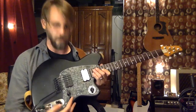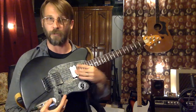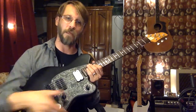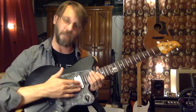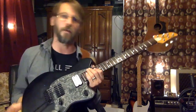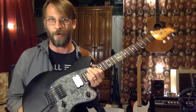Combined with our three-way selector switch — which in this case is not a three-way pickup selector switch — this only concerns the neck humbucker. So right now in the foremost position, that is a traditional humbucker but wired out of polarity with our rear position. This was very much a Jimmy Page trick; he used that for a lot of his nasally tones he managed to get out of Les Pauls. In the middle position it's the typical in-polarity — so at 50% you get that normal warm blend. And then in the back position, it actually just switches over to the front coil of the two coils, so the back coil is not in use, and it's wired out of polarity with our rear position.